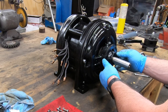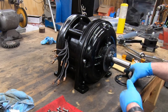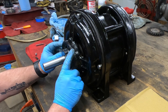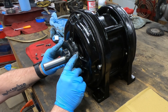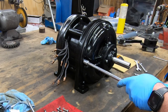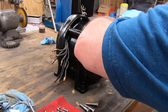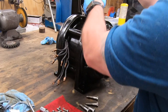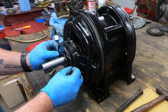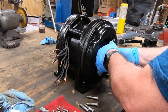This didn't quite go as planned. Like I mentioned earlier, these holes have to line up a certain way in both the end bell and the bearing carrier. I wasn't paying particular attention when I took this apart, so when I needed to put it back together the end bell isn't oriented the same way it was prior. I have to remove the end bell from the front so I can rotate it so all the holes line up in the correct orientation, and now I just need to determine which way to rotate the end bell and the bearing carrier.